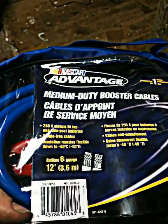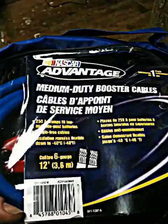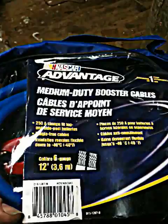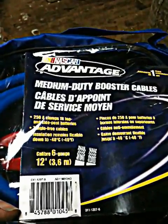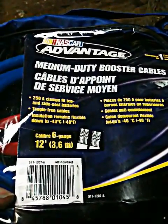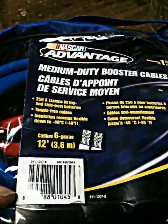Okay, this is one little secret — well, it's not really a secret — but if you have a hard time finding any heavy gauge wire for your DC wires, just go find jumper cables. Wait till they're on sale. They normally will tell you, like this one here, as you can see in the bottom left, it says 6 gauge, it's 12 feet long, it's got a positive and a negative wire.